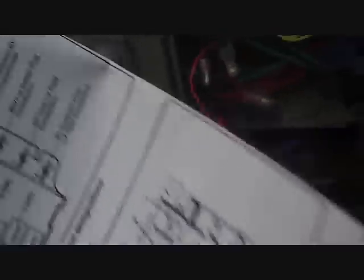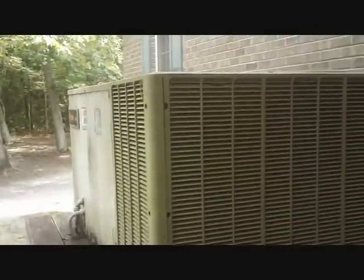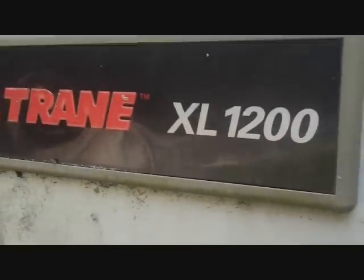After replacing the relay, I found the thermostat had also been affected and was bad, so I replaced it with one of my favorites — the Honeywell FocusPRO 5000. It's a very basic stat: fan on/off, cool on, with a built-in delay adjustable from no delay up to five minutes. It works with heat pumps, gas, and various systems up to two-heat/two-cool. I've used hundreds of these and had problems with maybe one or two, so we really like this one. We're about to turn it back on — hopefully we'll be good to go.